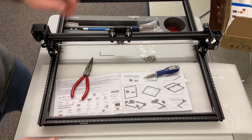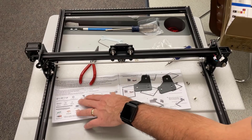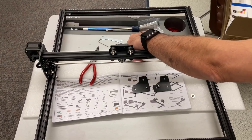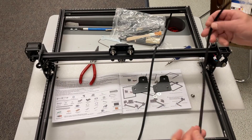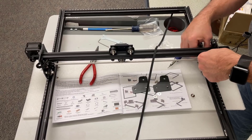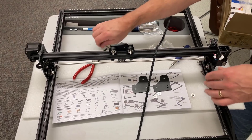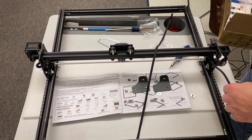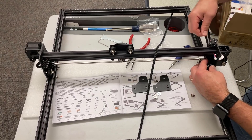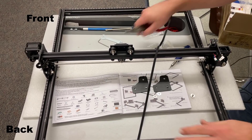Make sure you can find these two nuts because that's what we're going to use. We need to find two of our base anchors - remember if you can't find a part check the parts list, they're easier to spot that way. Make sure you find your M5 8 millimeter screws and two of the washers. Track down your timing belts - they were in this packet right here, they are wrapped kind of tightly. Let's attach the belts first - go over and under. I found that if I got one through I could push and it would pop out the back, and if you've got needle-nose pliers that's an easier way to grab it. Pull it all the way to the back, then feed this through past and do the same thing going to the front, making sure that you've got the little teeth down on that gear running through that way. Then pull that back - remember this is the back of the machine.